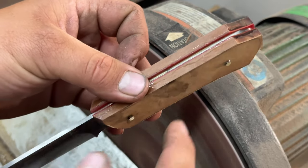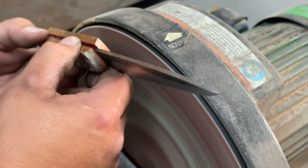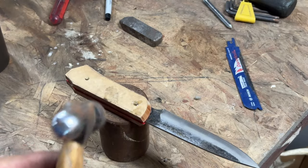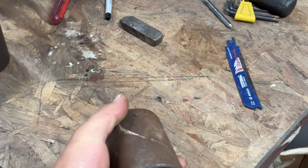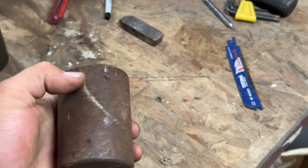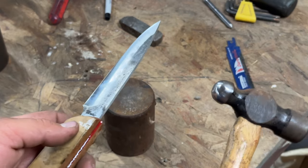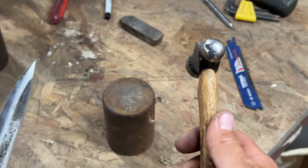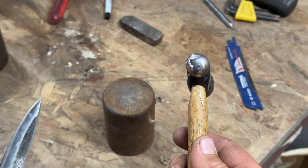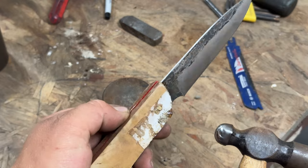Just a little bit left over — maybe a little less off of this side. When you're peening these you want something that's got a good solid base. I think this was a roller out of an old track hoe or something — that's what I've always used as my anvil for peening these pins. I have a ball peen hammer here with a polished head; it does make it kind of spread and flow the brass pin a little bit better in my opinion.